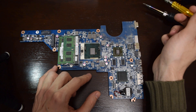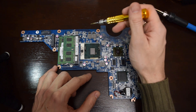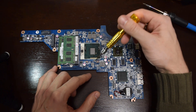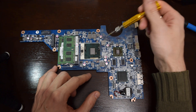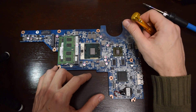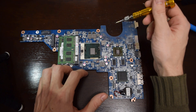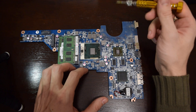You will find some coils spread on the motherboard, usually near the memory sockets and around the CPU socket. These are for CPU power and these for integrated graphics, and one near the GPU, which is our target. These coils are very important in providing the right voltage to these components, and if you remove the right coil, your dead GPU will be eliminated from the circuit.